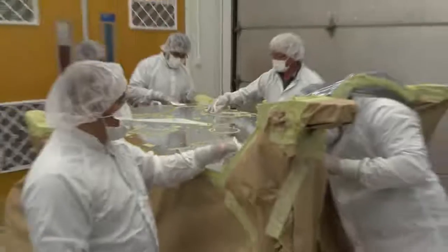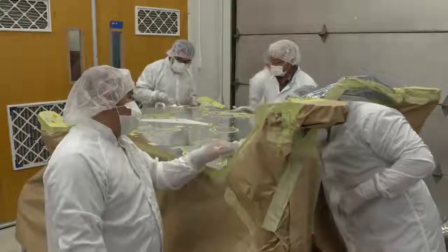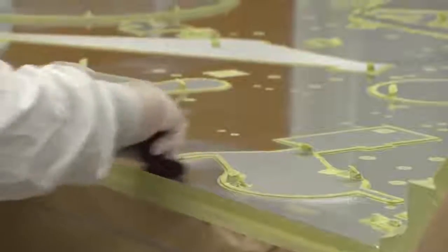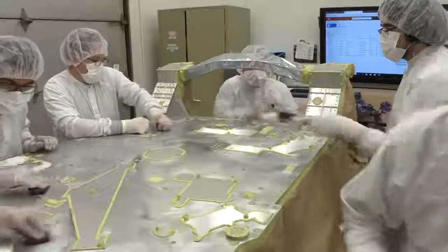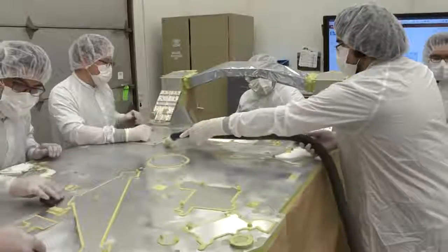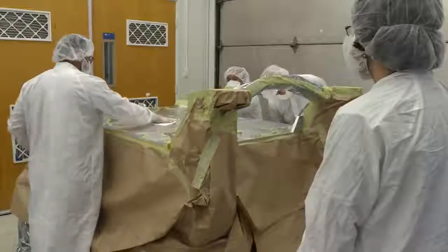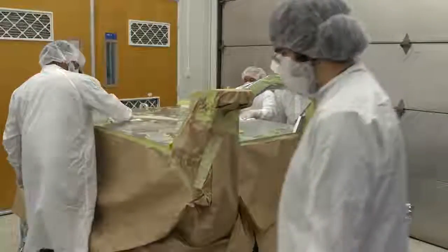To prepare the aluminum surfaces, we have to make sure they're very clean. The shiny aluminum surface is then reduced to more of a scuffed surface that's ready to accept paint. This generates dust as well. That all has to be cleaned and vacuumed off so that we don't have any particles that are going to get under the paint and keep it from adhering or cause it to flake off.